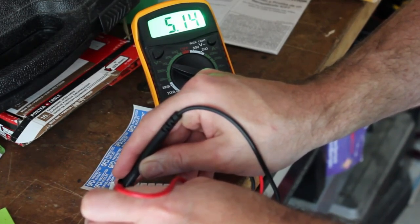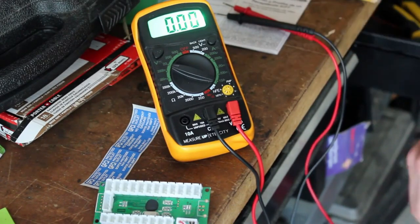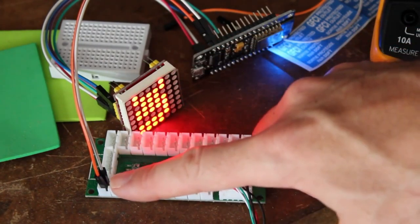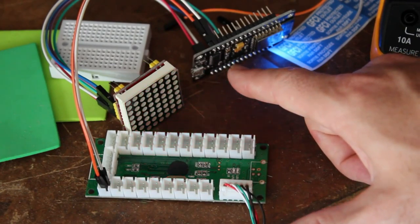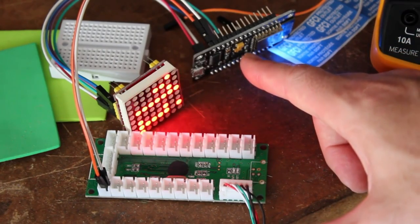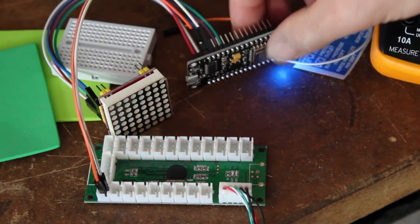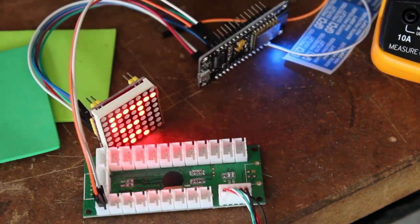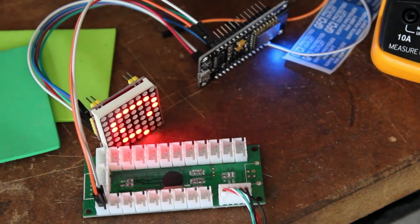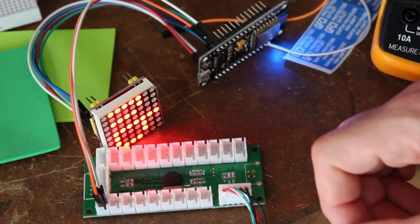I'm going to go ahead and wire that into the ESP and see if I can get it to work. I didn't have any two-pin connectors, so I just used single-pin female-to-female jumper wires, going directly into the ESP8266. It seems to be powering it just fine. I'm still not sure how I'm going to mount the ESP inside the board — it has mounting holes, but pins are in the way. I might mount it facing down so the pins are up, or mount it on a little breadboard. It is working — I'm getting power, one power line in through USB and then to the ESP.